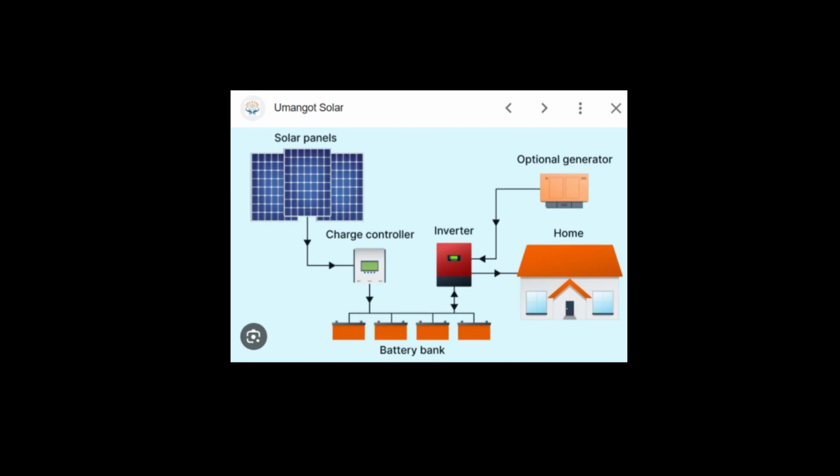I'm going to talk a little bit about what it takes to be a grid tie system, and that is everything you use must be UL listed, certified, or approved. Okay? I'm going to put that out there. I am not an electrical engineer, but I do know that if you're going to try to get it past the building code and attach to your power grid, whomever is your power grid, everything has to be UL approved, certified, or tested to UL standards.